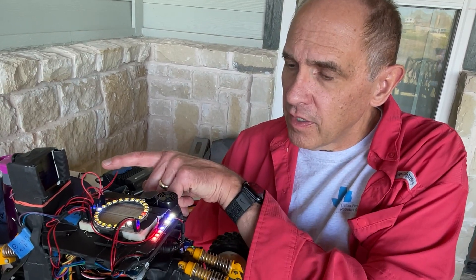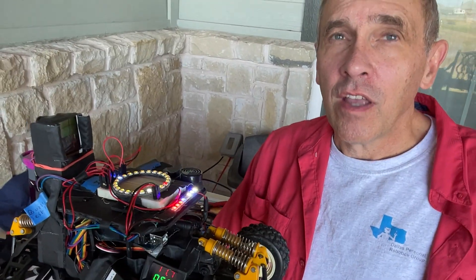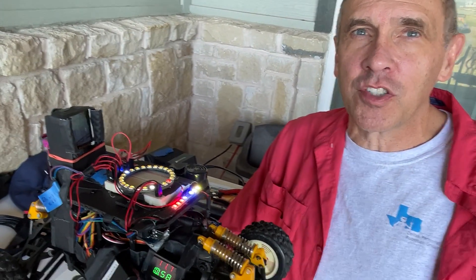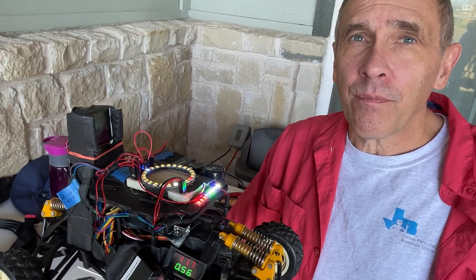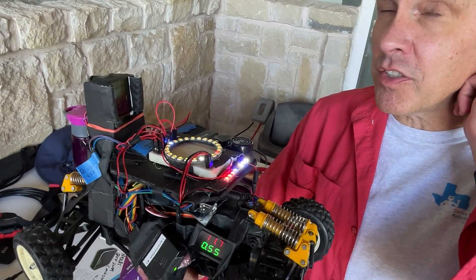The serial port runs at 115,200 baud. The packet is two integers — 16 bytes total. Originally three years ago this was 9,600 baud, but that was blocking the code for too long, so we sped it up. The suggestion is to kick the baud rate up even higher to further minimize the chance of packet collisions.